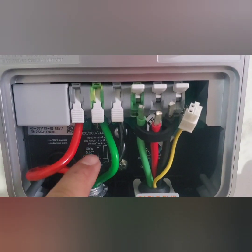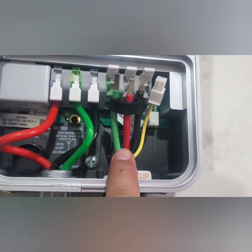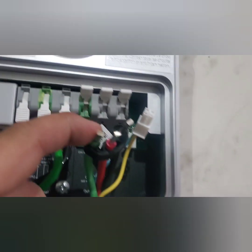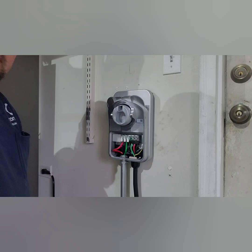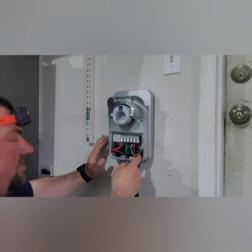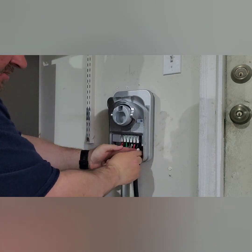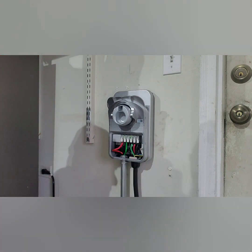Basically you just strip the ends off a half inch. On this one the middle wire is the ground and the two hots are on the outside; on the other one the ground is on the outside and then your two hots and the sensor wire. You just push them into their slots and flip those down. I got them all in their spot, flipped them down — now it's tight — then just put this little sensor deal in here. Now I just have to go downstairs and wire up the breaker and it's good to go.